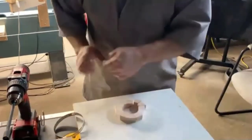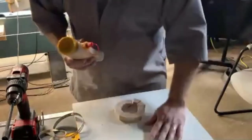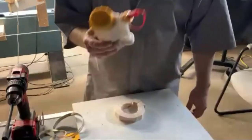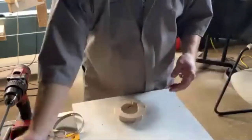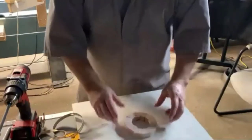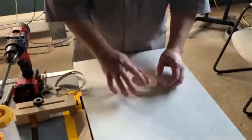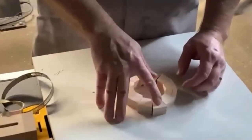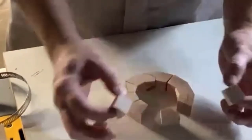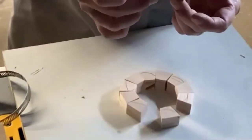So in my glue up process, I'm not actually going to glue it here because you guys know what glue looks like when it's dry. I would pour myself a nice little puddle of glue, maybe two inches or so, and I'm going to glue up my segments in pairs. So I leave the first segment at the 12 o'clock position where it's at. I take the two on either side, dab those in glue, kind of smear it around,